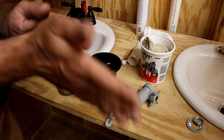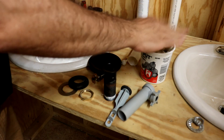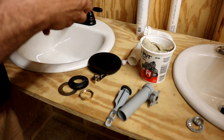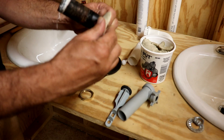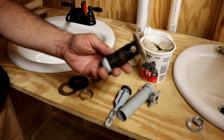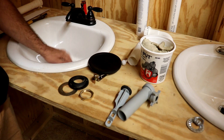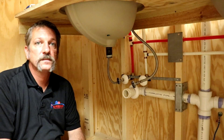What I do is make a play-doh snake with the putty — remember those from when you were a kid. Save your extra putty; there's nothing wrong with it as long as it doesn't have trash or wood chips in it. Go around the drain with your little putty snake just like that. See how the holes are not obscured or clogged — you're just sealing right around the top. Then you drop that down in the hole and we get to go underneath.